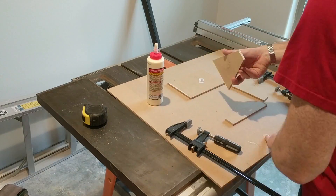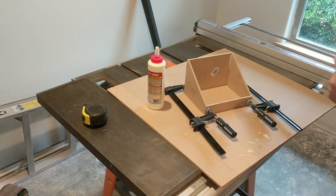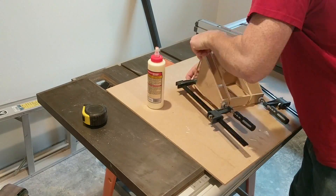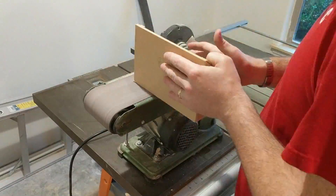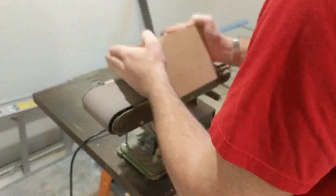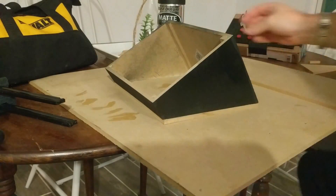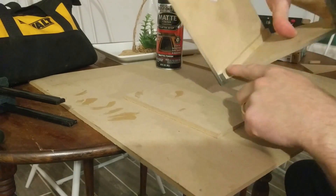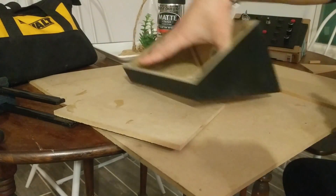I asked my dad to help me with this part because no matter how good you are at woodworking, your dad is always better at it. Then I glued it all together. I added some small rectangular pieces to the corners for strength and because I thought I needed the extra material for the screws, but it actually ended up causing more problems, so do this step at your own peril. The rubber bands help clamp those weird angles together. After this dried I took it to a belt sander to get all the edges looking nice and to make the angled section all one flat plane — this is important since the base must be flat for the whole thing to be stable. At this point I realized I had made a mistake: I had originally planned the bottom piece to simply sit on the bottom and screws would go up through it into the thin corner pieces, but I realized that it just looked ugly and the screws were going to have to be drilled in at a really weird angle.